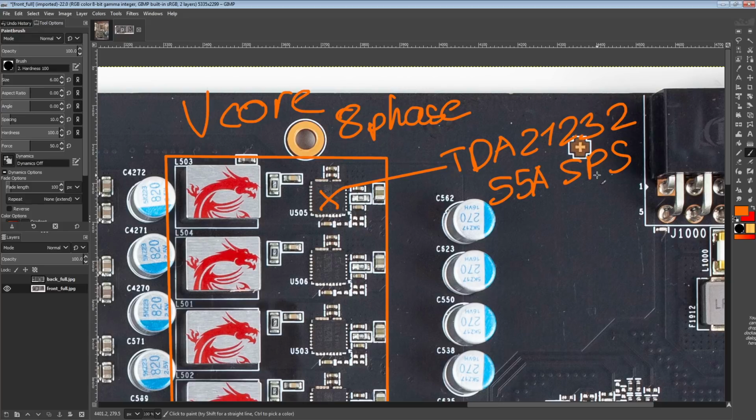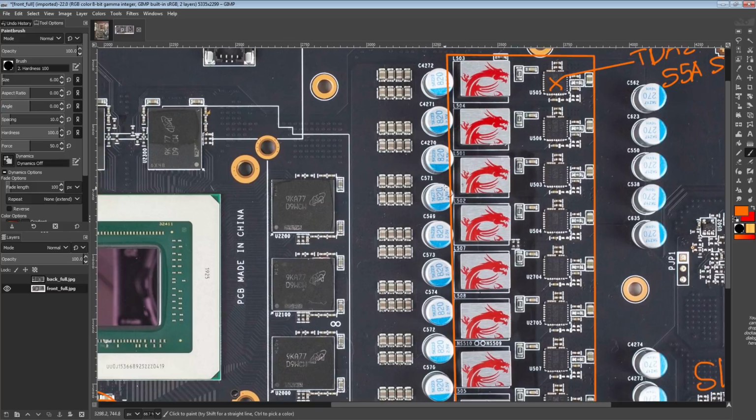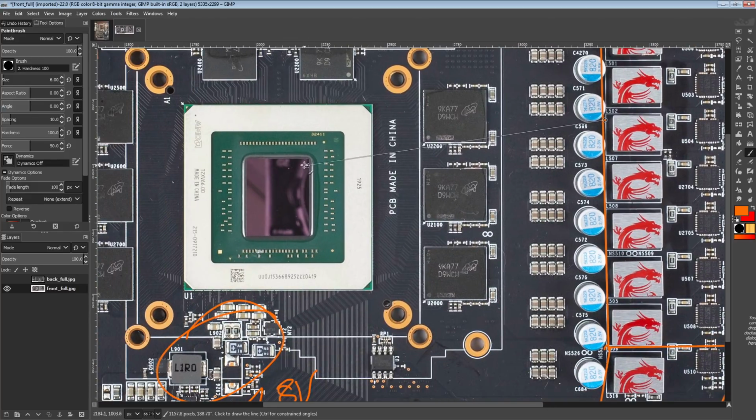Also, since they're a smart power stage, they integrate much more accurate current monitoring than what you'd get on some of the previous generations of power stages. Or there's power stages that just don't integrate current monitoring at all. That's also an option. They have integrated temperature monitoring and a bunch of integrated safety features like overcurrent protection and other things that I don't care about because they're details.